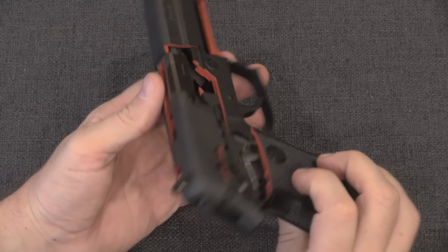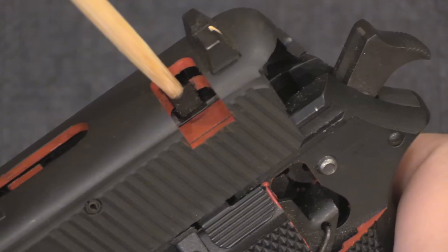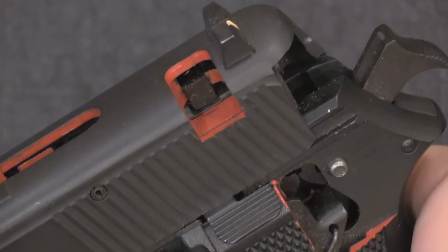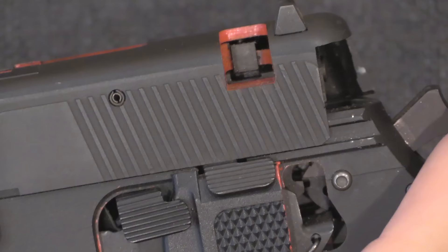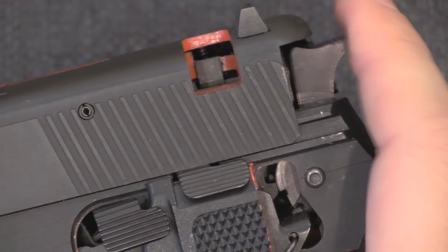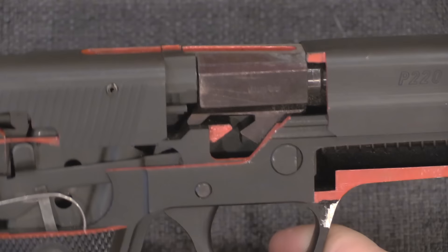Conveniently, we have a cutaway of this exact style of pistol. The firing pin itself is down here at the bottom, and we have this block that is dropped down into a cutout in the firing pin. As long as this block is down — and it is spring-loaded so it's always being pushed down — that prevents the firing pin from ever moving. This acts as a drop safety: no matter how much force the pistol impacts with, the firing pin can't go anywhere because it's physically blocked. However, when you pull the trigger, that lever pushes the blocking bar up, which allows the firing pin to move, and when the hammer drops it pushes forward. If you're not pulling the trigger you can't push the hammer forward either.